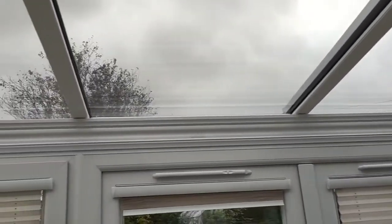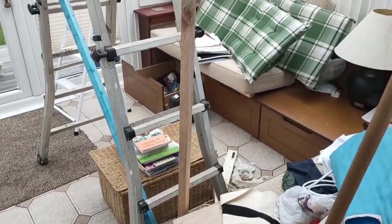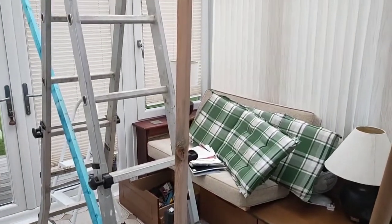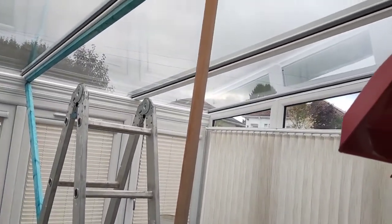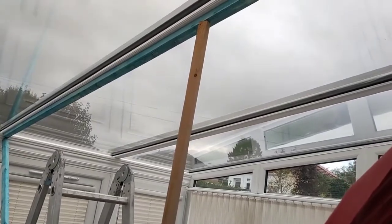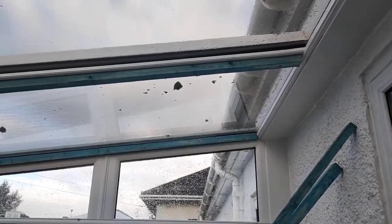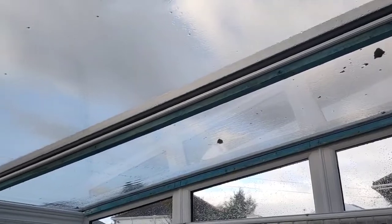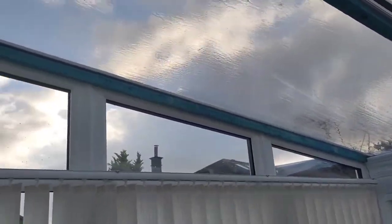In the second video clip you'll see one of these mounted, and because I'm doing this on my own, what I've done is I've used 2 other wooden poles to jam the batten into position against the glazing bar so that I can drill the necessary holes for the self-tapping screws. It's important at this stage of the process to make sure that in drilling into the glazing bars, you drill right through into metal, not simply into a plastic covering or casing.